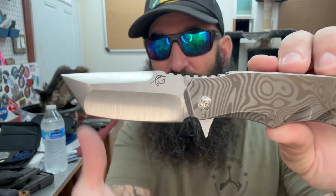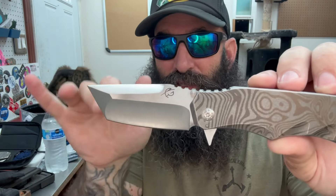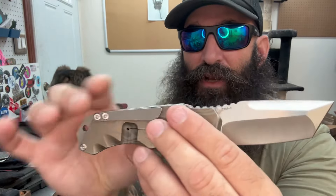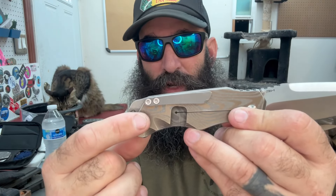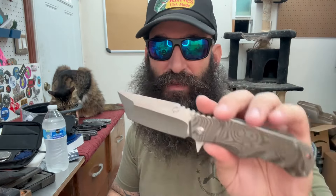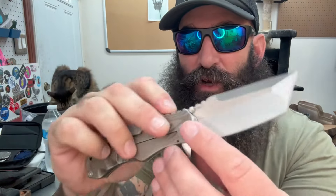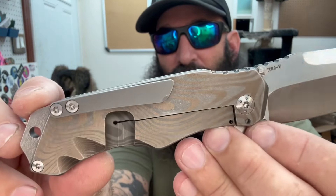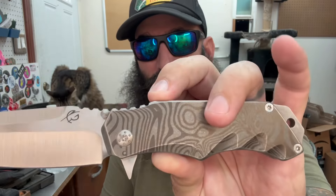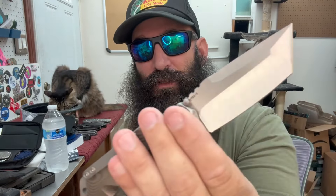All three bevels have been reground — I basically mimicked what was here and here, then put a big hollow where before it was faceted. Overall I'm pretty happy with this knife. I wouldn't mind owning something similar — it's actually a pretty cool knife. Pocket clip placement kind of sucks and I thought about asking her if she wanted me to move it down, but there's another hole there so you'd have to fill that hole too. It could be done but it's going to look unfinished. I wanted it to still look like it could have been a Scorpion Six from the factory. After all the rounding work I stone-washed it again, and the stonewash took a little of the bronzing out where it's not lasered, so it kind of looks plain stonewashed now. But the lasered work still has that nice bronzy look.